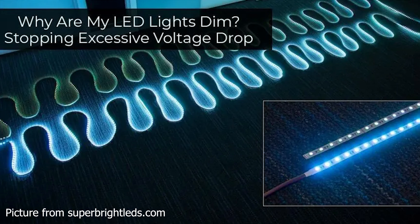Deciding what voltage is really up to you, but understand with 5 volts, the further your strip goes, the more chance of having voltage drop. Connecting both ends of the strip could solve this, but in my opinion it's just an extra step when you can just get a 12 volt and it runs a bit further. If you get a 5 volt metal box, you can also power your Pi, but if you go 12 volt — like I recommend — then you'll need a 5 volt power supply for your Pi. Don't worry guys, I'm leaving links to all of this stuff in the description box below.